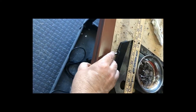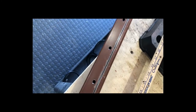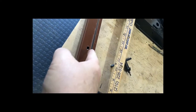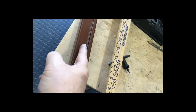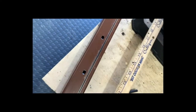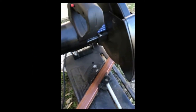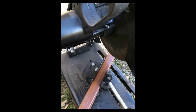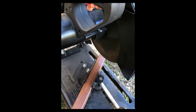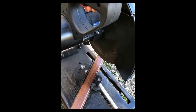Another thing that makes it a little easier to get the connectors in: I reamed out these holes - took my drill bit and a hand drill and kind of angled them, because I drilled them straight in and then angled them, just worked it out so the connectors would go in smoothly. Here's the metal cutoff saw we used to cut this tubing. I'm going to go ahead and cut a 35-degree angle on this piece for the top railing.